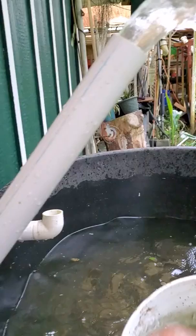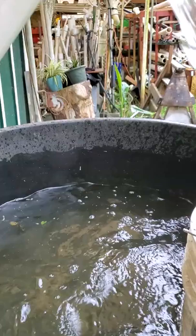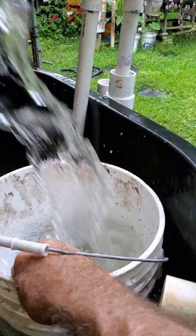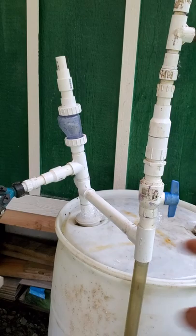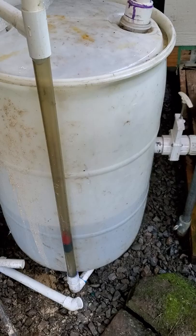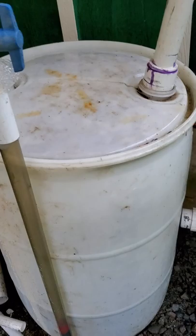If you can do five gallons in under 12 seconds — ready? On your mark... 20 seconds... 10 seconds... 5 seconds... 11... 12 seconds. So you're doing just fine. You've got no electrical out here. This is the weighted valve underneath inside. When it gets down and burps the air one time, the weight will let it drop down, and then she'll cycle and go again. We're at four minutes right now for a cycle — 55 gallons in five cycles. If it was five minutes, that'd be 10 gallons a minute.